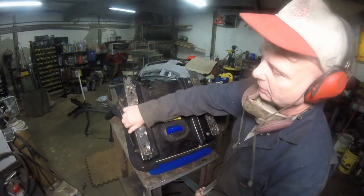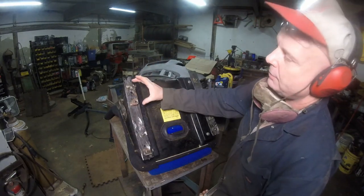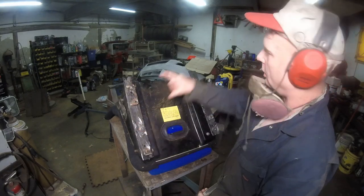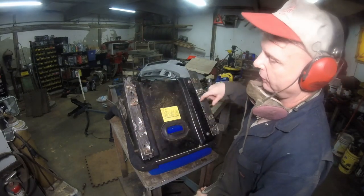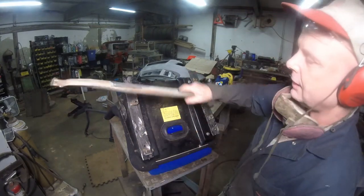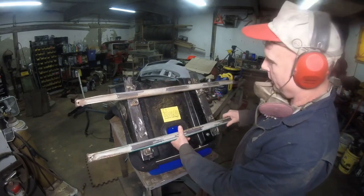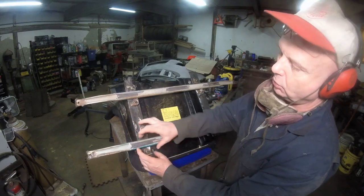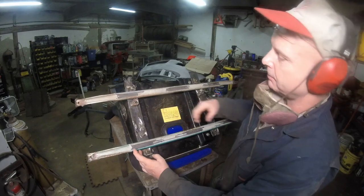Here are the plates. Here's the seat frame underneath it. The seat frame has four holes, 1, 2, 3, 4 on all four corners. What I did was 1 and 4 holes all the way around. Just means I had to drill 4 holes, that's it. With these things cleaned up, these are the facade door bars, this is how they're going to sit. So you get the most amount of retention because you're in between two bolt holes, this will all be welded together, and there'll be a plate welded right onto here.